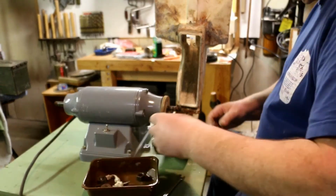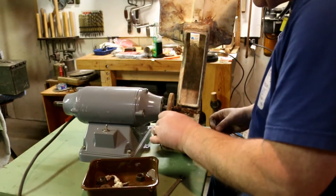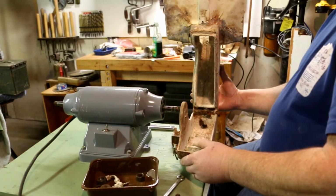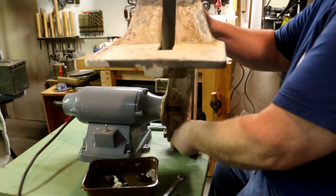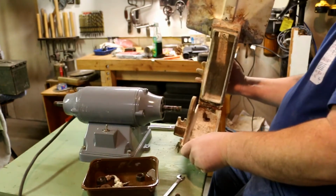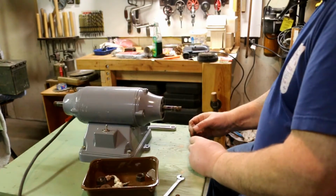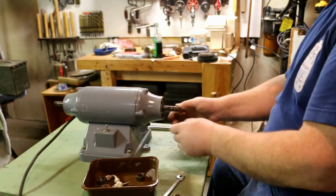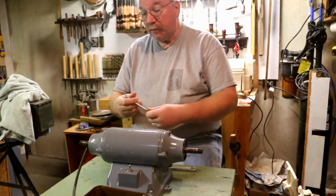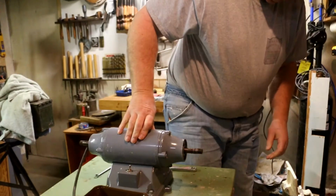Now, I would have expected this thing would be held together with stainless bolts, but quite obviously it isn't. Oh, and I should have recognized something. Even though this bolts right up, it is a quarter turn out of position. Would have recognized that sooner or later. So taking the bolts out and spinning the end bells is probably a requirement. Okay, we're going to have to turn the bell housings on this motor. So first thing I got to do is loosen those bolts up.